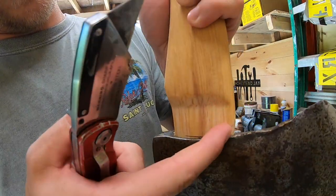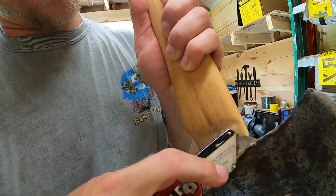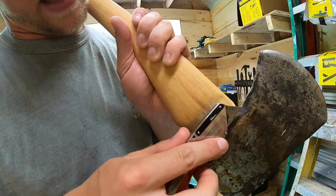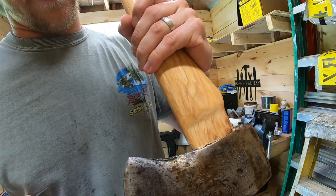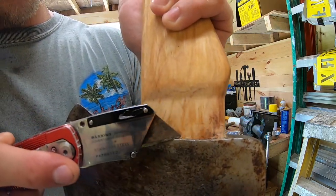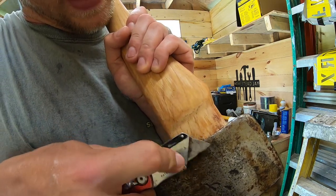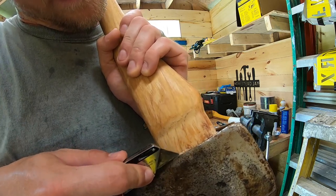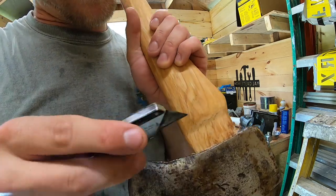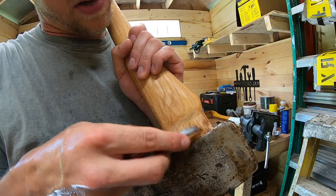Don't be afraid — if you see there's a little bit more wood than needed, use a sharp razor blade to peel it away. Your axe is going to sit down to its shoulders anyway. The axe head is starting to bounce and not get past this point, so take the razor blade and bevel this down a little bit. This gap here means the axe head is just bouncing. Take off the high wood — I'm just demonstrating here — but don't be afraid to free up wood around the head because you still have a long way to go.